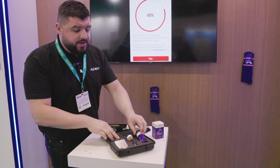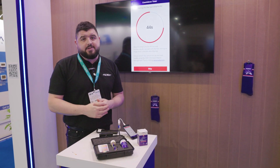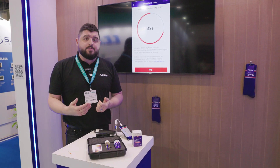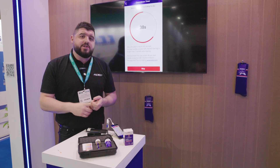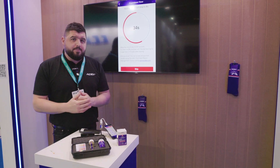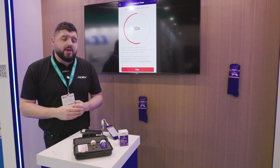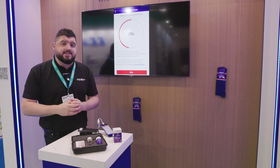You may be wondering what inhibitor this test is for. It is a universal test, so any inhibitor that contains molybdate will be picked up on this test. We're also measuring for corrosion, which is dissolved iron, and pH level as well. It's a test that completely covers you for BS 7593 and gives you a really good average and example of good or bad system water quality.